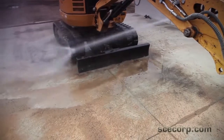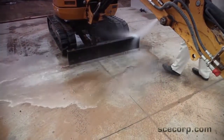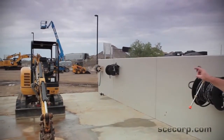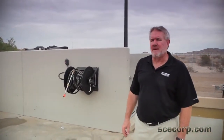Basically, equipment comes on this pad and the heavy solids and dirt are knocked off with a 25-gallon-a-minute at 500 PSI water blaster by Water Maze. Then we go over to a hot water wand — 5 gallons a minute at 3,000 PSI, 200 to 240 degrees, by Landa. It's a model ENG.